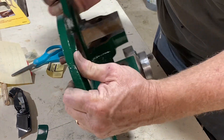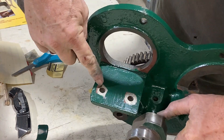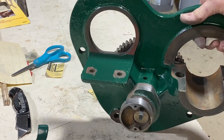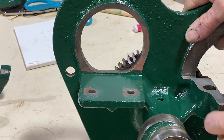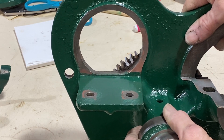This was also the time to start removing all paint around the bolt holes on the magneto mount to assure good electrical contact. Also remember to mark the large gear timing marks — I used a white marker.